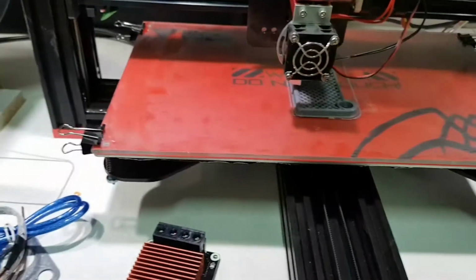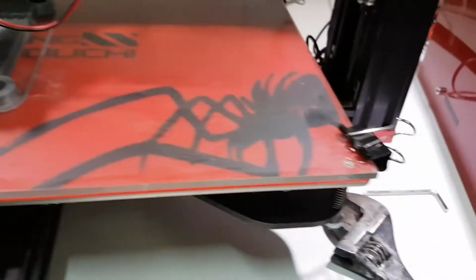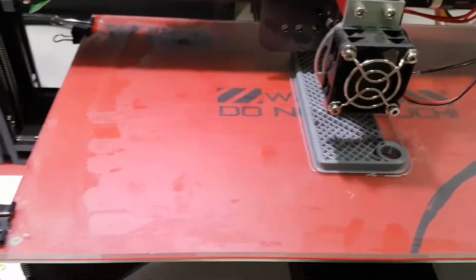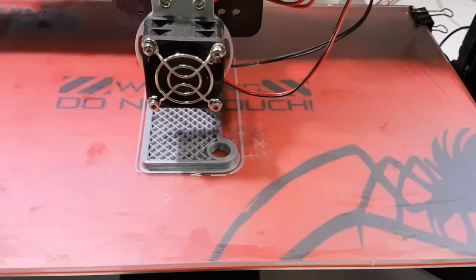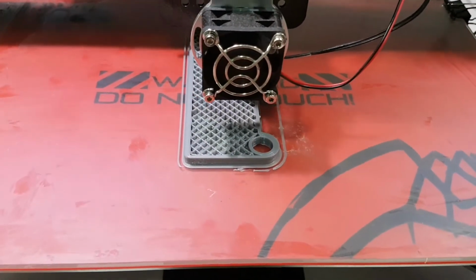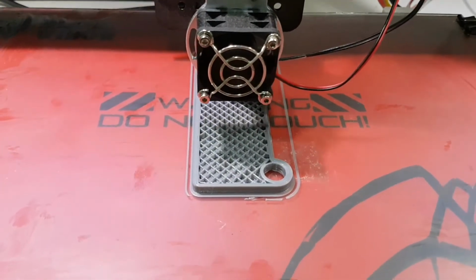The manual adjustment's very easy on this guy anyway, because they're on the extremities. They're simple, like a little thumb nut sort of thing. And I ended up putting this 4mm glass piece on there, which I just had a glazier make up. Currently I've just got some very thin PVA. I could have used AV56. Anyhow, I'm just using the PVA here because I'm just printing basically test pieces, and I don't need the superb holding power yet. I'm not doing anything too crazy yet.